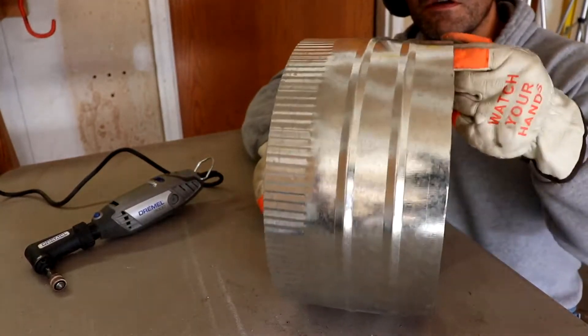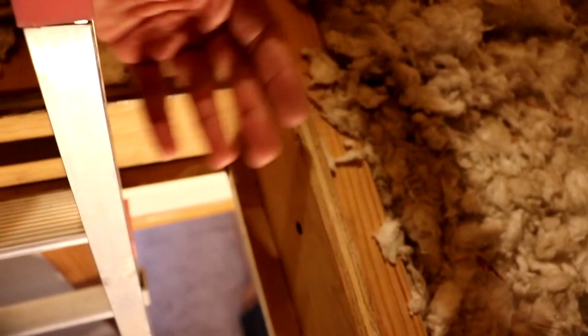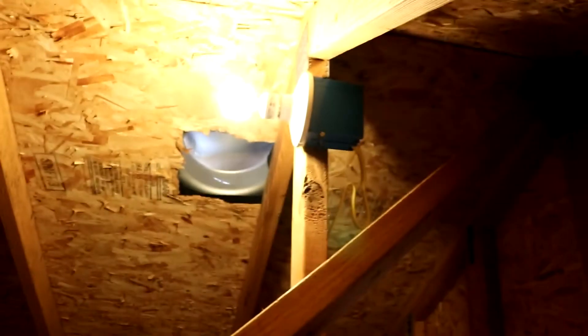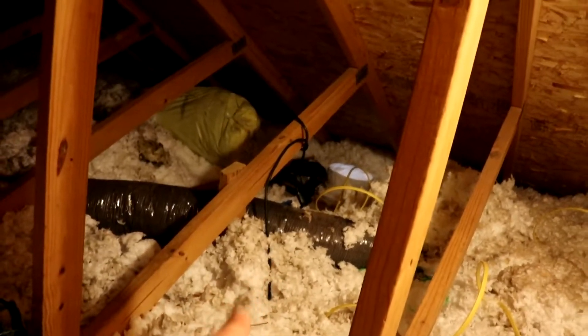That's good and ready to use. I just climbed up the ladder into the attic. There was one wire here that was short and went right across the attic opening, so every time you opened the cover you had to finagle it around that wire. The electrician put a junction there and extended it around to the light, added a dedicated light bulb inside the attic, and brought this other cable up through the wall — this goes down to the wall switch. That's what the fan is going to be plugged into.